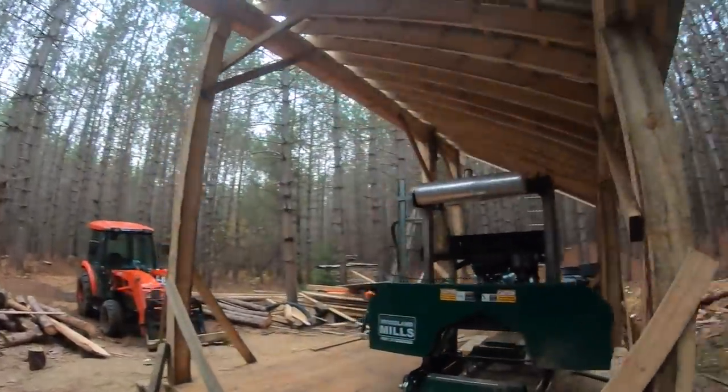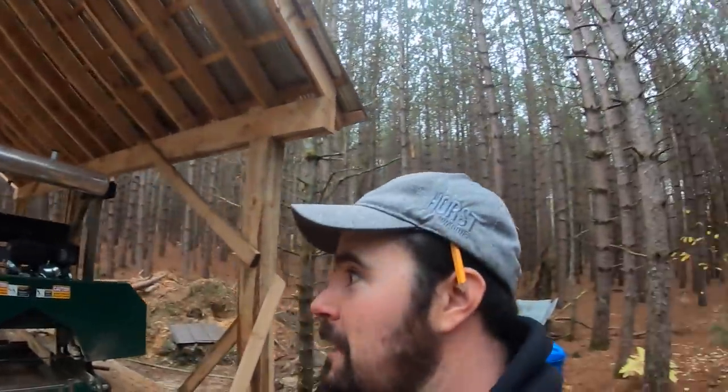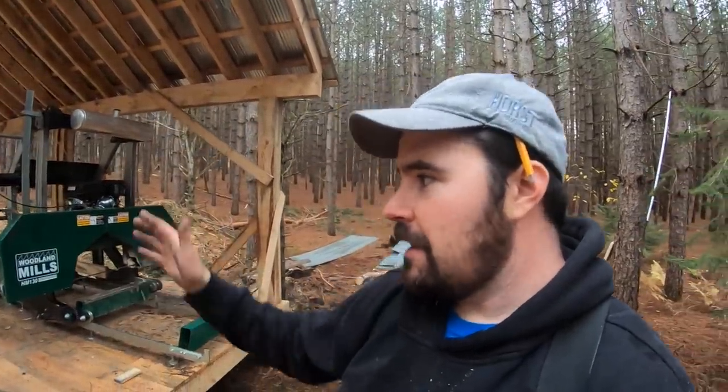So everything was square, and that was the main thing. You guys saw me talking earlier when I was framing this, of the importance of things being plumb and square and level. Well, this is the opportunity for you to see if this building was not square. When you do stuff like roofing, you would definitely notice. And honestly, it's a sign of a rookie.